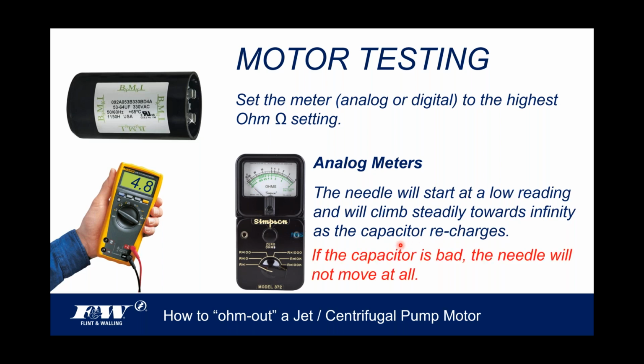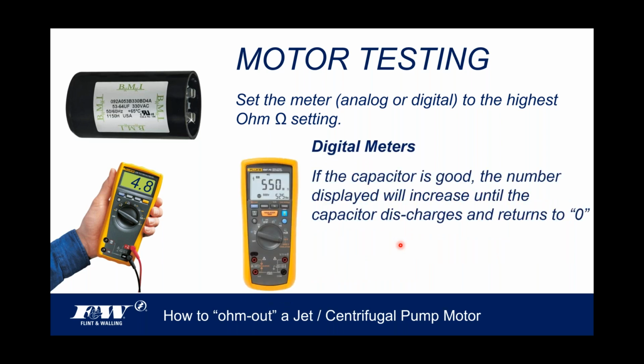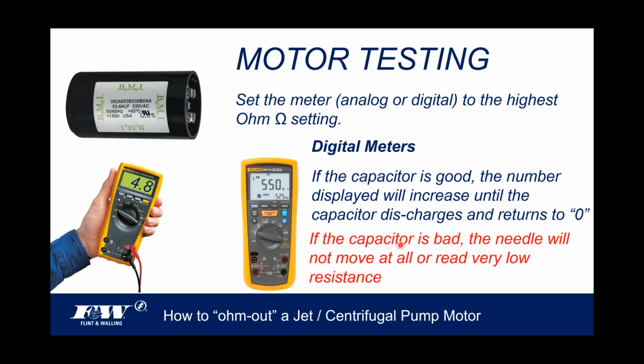If the capacitor is bad, the needle will not move at all. Okay, another pretty black and white test that we can perform on a capacitor. If we're using a digital meter, again, if the capacitor is good, the number displayed will increase until the capacitor discharges, and then it will go back to zero. So on a digital meter, you'll see those values climb up, and then they'll fall back. That basically tells you that you've charged the capacitor and discharged the capacitor. In this case, if the capacitor is bad, the values or the needle won't move much at all, or it's just going to read very, very low resistance. That's going to tell you you got a bad capacitor. That thing ought to go all the way to infinity and then swing back. That's what you're looking for.